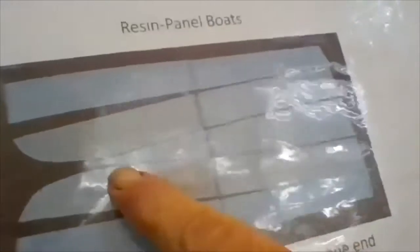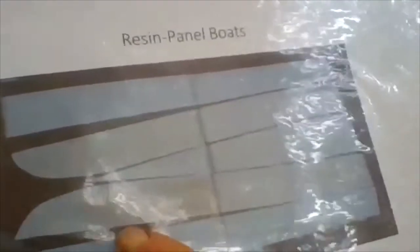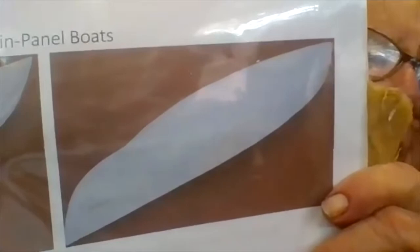Going back to old technology of paper — printed paper. How this all happens is I lay up a whole bunch of panels. Here are the end panels, five of them across the boat, then the middle panels, then the end panels are repeated to make the other end. The idea is that I make lots of flat panels and then tie them together. That is what happens when those panels are tied together and then stuck together with resin and fiber.